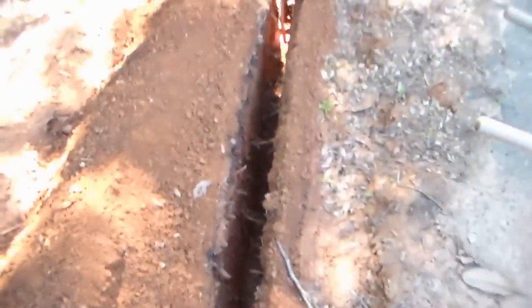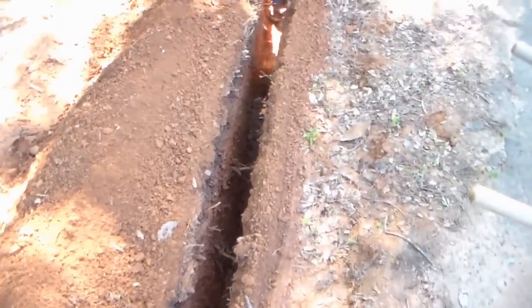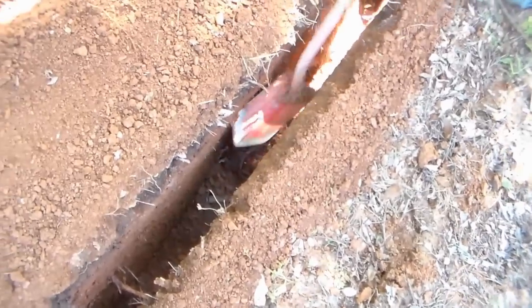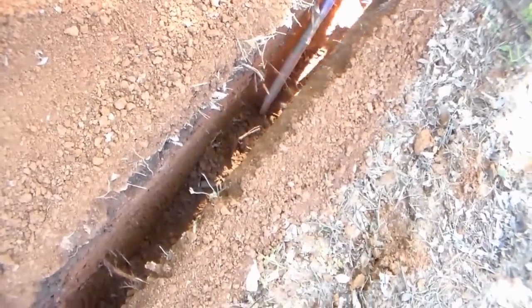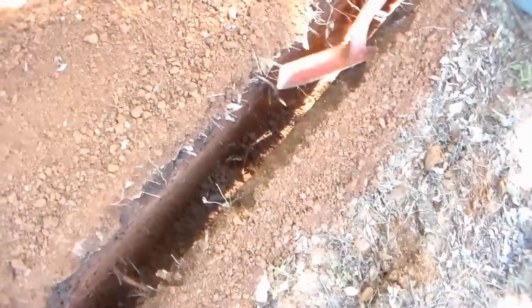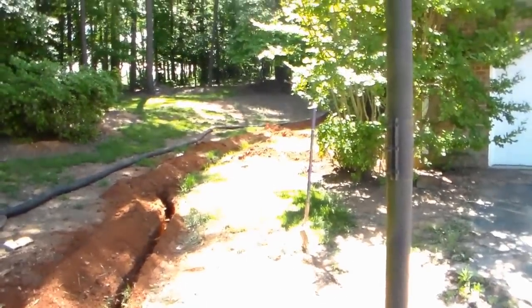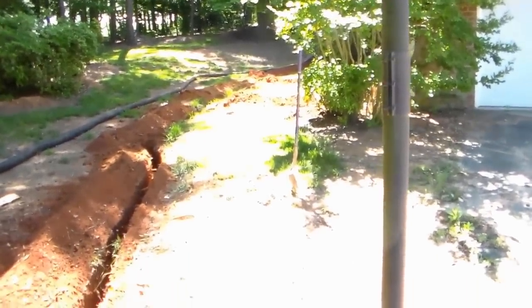Total trenching time here has been about an hour and a half. You can see we're really deep down here — Derek's standing down below his knee. This is really the slowest part of the job: cleaning this trench out. We've got the trenching shovel and it just barely fits in there, but it's a long ways down so it makes it really hard to get all that dirt out. We have to be deep because it's low back there by that flag — that's the low spot. There'll be a catch basin in there. The grade of the yard actually comes uphill as it comes around the corner of this driveway, so we're real deep along the side, getting deeper and deeper until it starts to go down the hill.